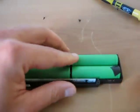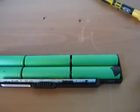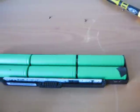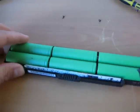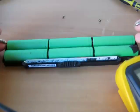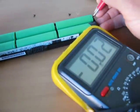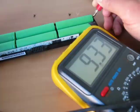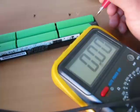Another interesting thing: when you change your batteries, it's advised to make a calibration of the battery pack. You can do it from your laptop — some laptops support it from the BIOS setup. But you can easily do it by fully charging and fully discharging the laptop, and the electronics will learn the new capacity of the batteries. Here is my battery pack — it's empty right now, so I'm in the calibration process.